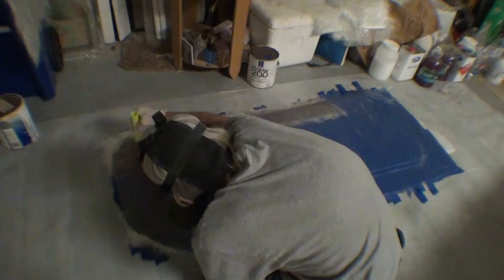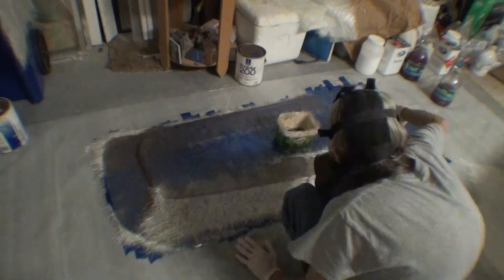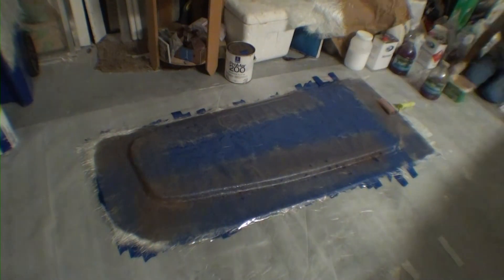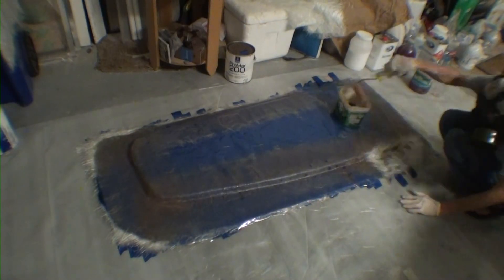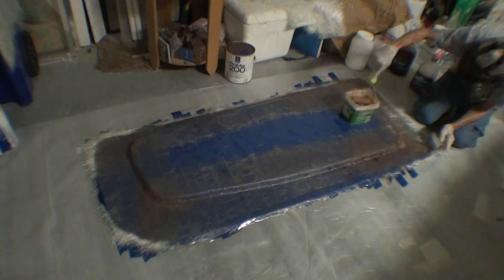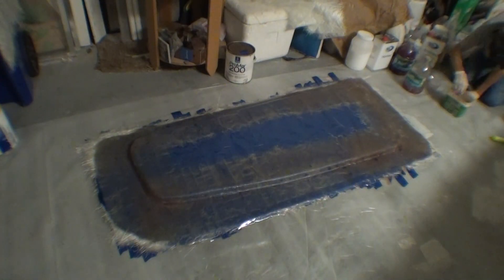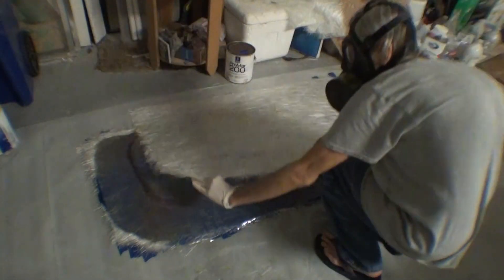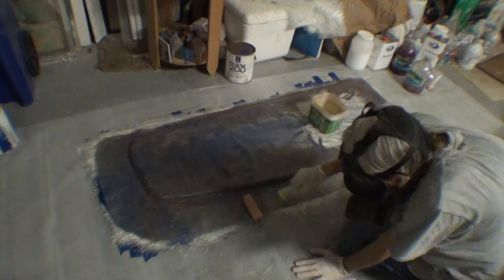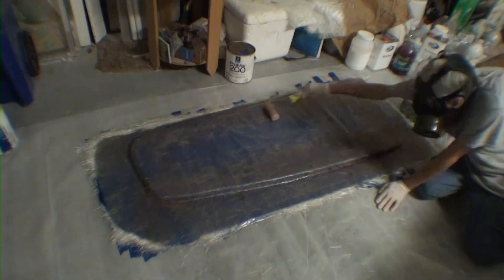To complete the experiment, I lay fiberglass over this to recreate the part. There are about three layers everywhere all around, and once I've finished doing the edge — which is really the part I'm interested in — I put one big piece over the middle. That stabilizes the part so it's less likely to break during the demolding process.